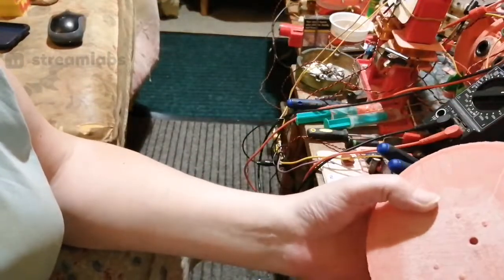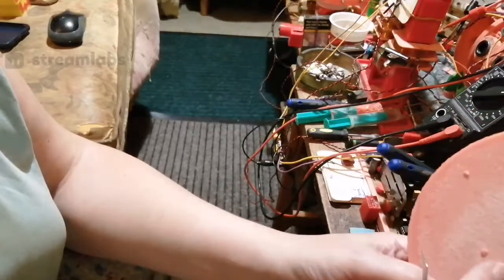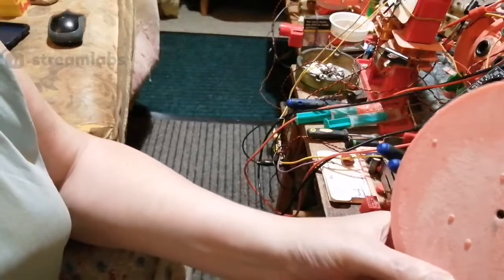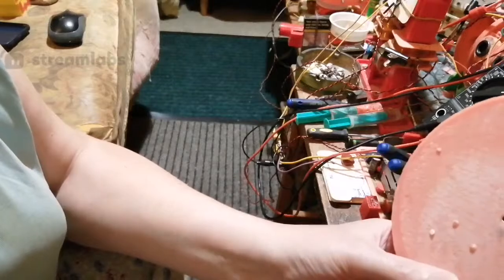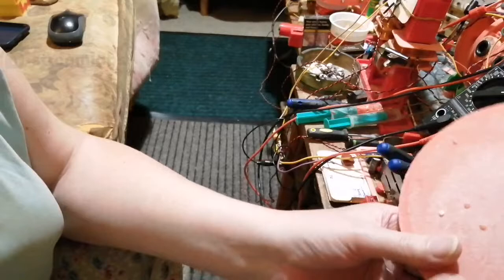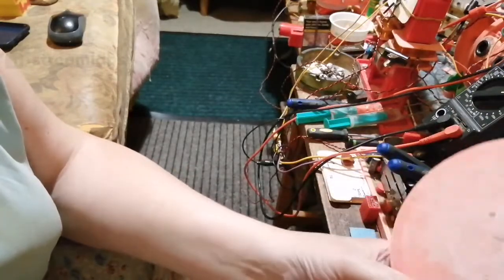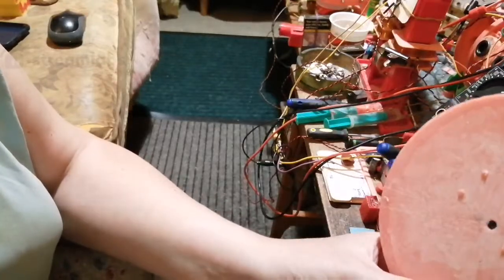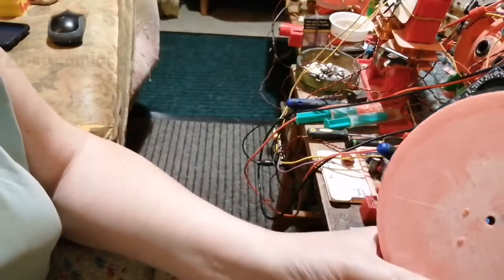I've got some holes in the printer bed and the aluminium, so every time I print something, it's an advantage sometimes because it holds things down, but I've just got to go around it like this and chop these things off every time. Sometimes I try to put my prints where there were no holes, but when you're printing a large thing like this, a really big area, and you want to make sure it doesn't come off the bed, these little plastic holes in the bed are useful because then it holds everything down really well.